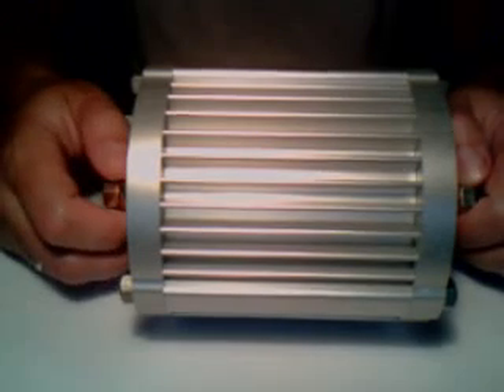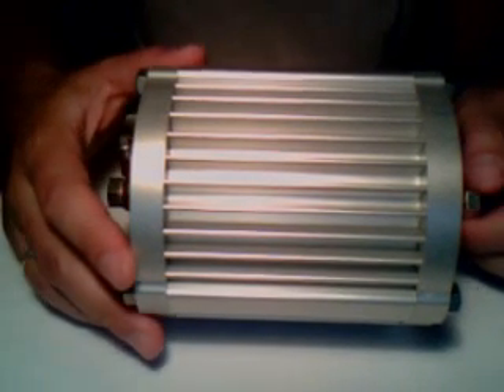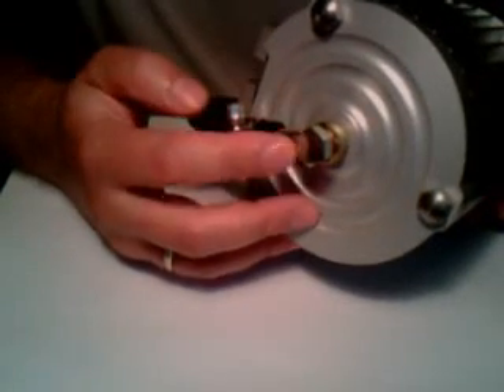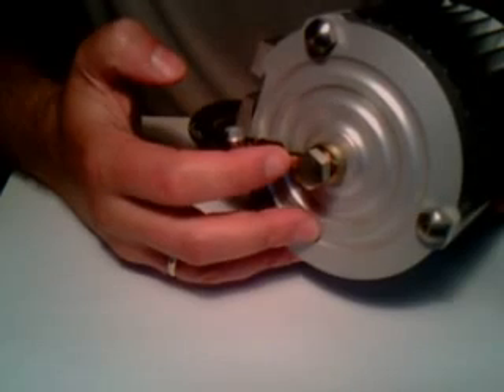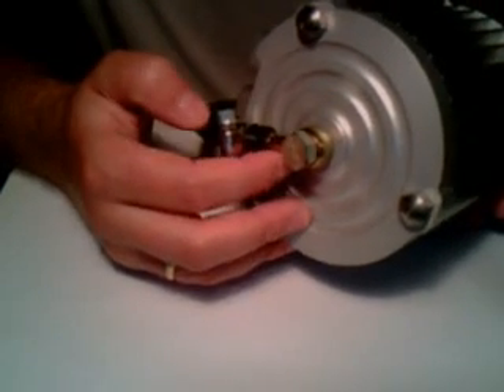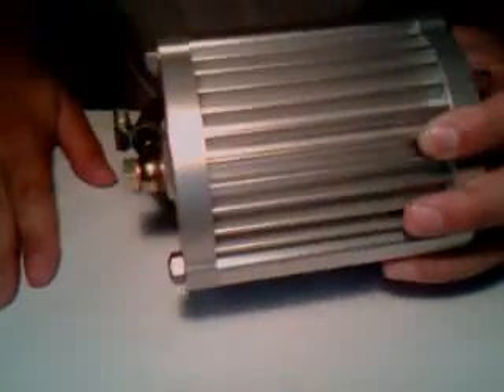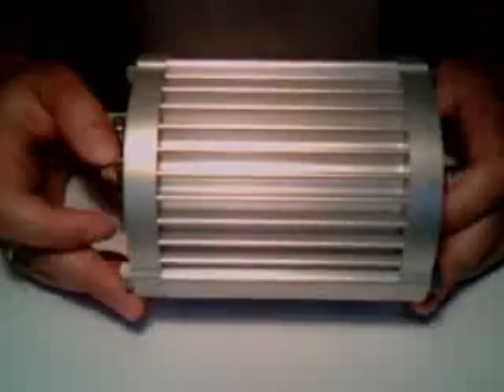For the standard installation, we have these hollow screws, these ring nipples or ring fittings, and this rubber-reinforced hose which is fixed on these ring fittings with a hose clamp. We use this standard hose for standard installations where you have good access, no extreme temperature ranges, and where you are on the pressure-free side of the filter.